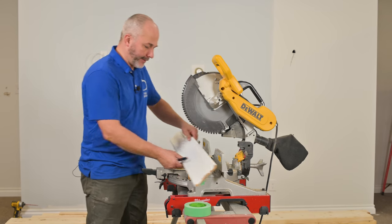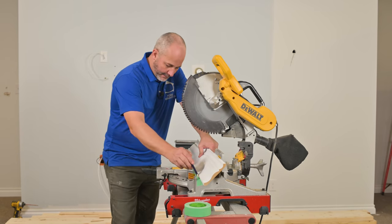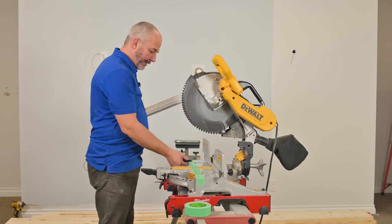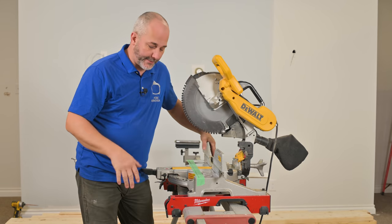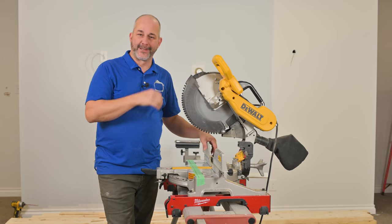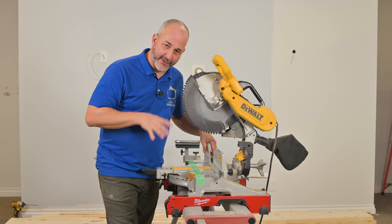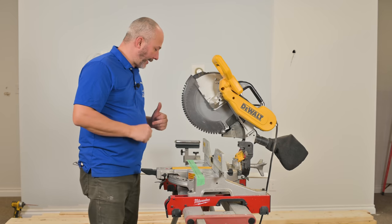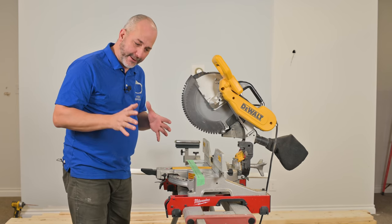Now, I'm going to put my material here and line that up. It'll be a lot easier to set that up as we go. In the tutorial today I'm just going to do an inside corner and an outside corner, show you all of those tips and tricks and some LED strips. I'm not actually installing crown in a whole room — this is just a quick tutorial to show you all the process. First thing we need is two jigs: we want an inside corner jig and an outside corner jig because that will make life a lot easier.